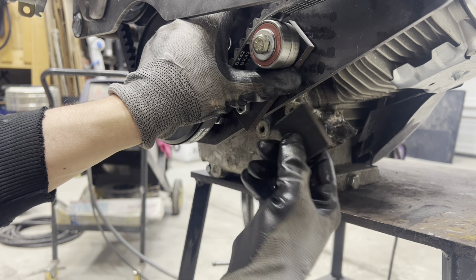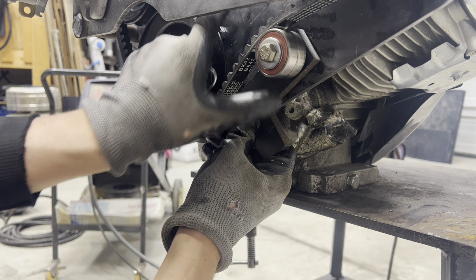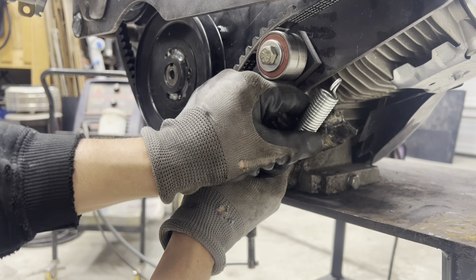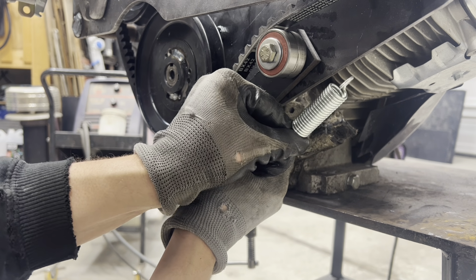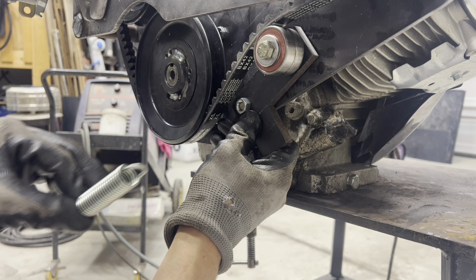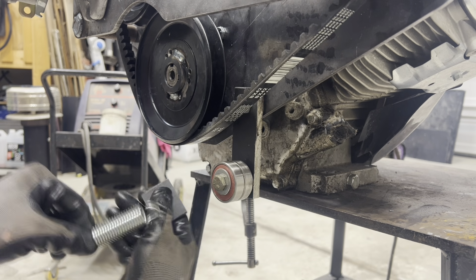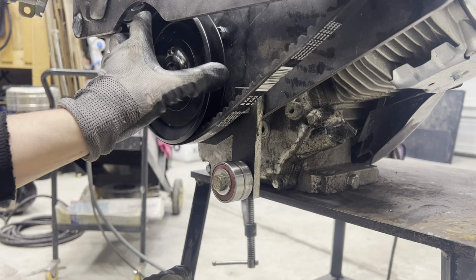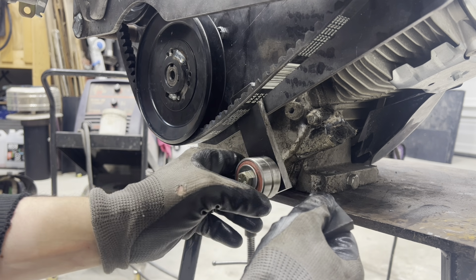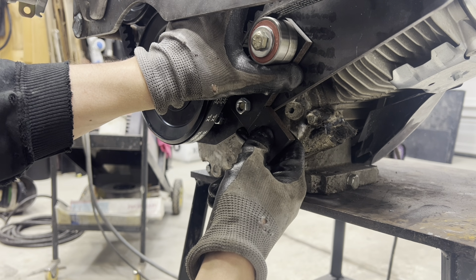We're going to weld another little piece onto there to make a little L shape. To that, we're going to connect a spring, and that'll be what keeps this whole belt tensioned. If we need to, we'll set it up so you can disconnect the spring and relieve the tension, so that the engine can freewheel. You could get it started, let it warm up, and then once it's warmed up, engage the drive system for the pumps.